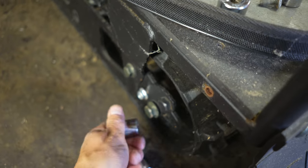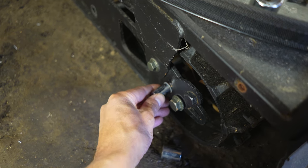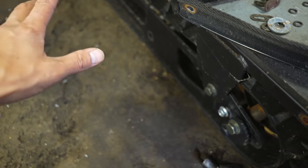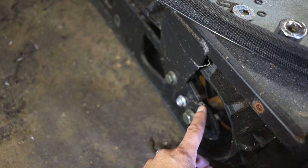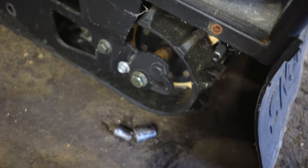And this is 17 millimeter. And this is 12 millimeter, just to save you guys some time. And then what you're going to do is spin that back, and that will loosen the tension on the track. And now mine has a nice little rust spot where it was before I took it apart, so just make sure you either mark that or follow your manual for track tension